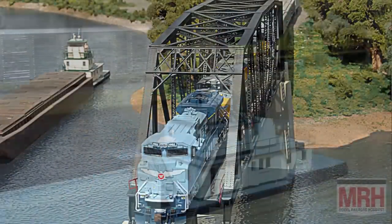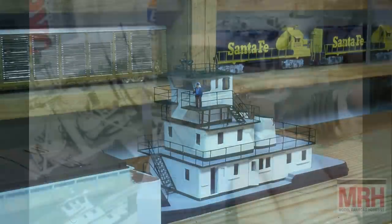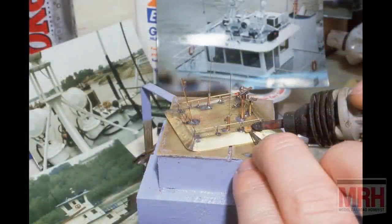Remember the green tugboat we talked about that I built all the stanchioned handrails and the top with brass? Well, using the resistant soldering rig and using this brass table that I've just described to you to build out of a block of wood and putting brass on top, you can see where I only need the pencil tip in small areas. The alligator clip's off to the side, my flat surface is grounded, so I'm able to solder on the lights, the antennas, the handrails, the roof's angle. All of that was carved out of a sheet of brass and soldered all the parts onto it.